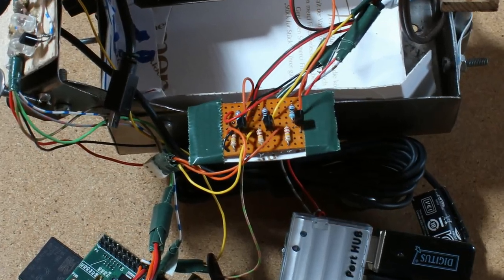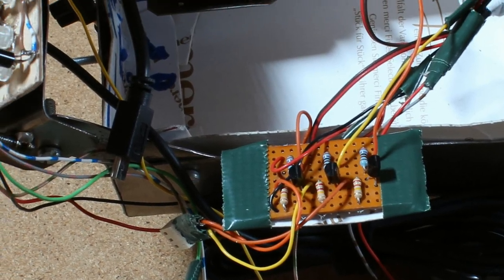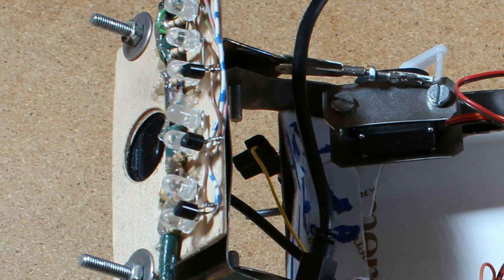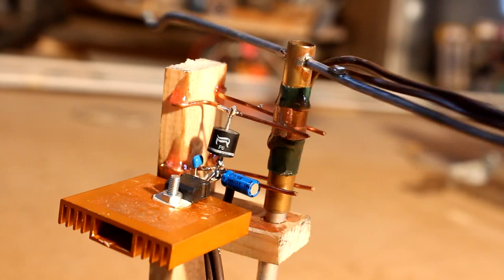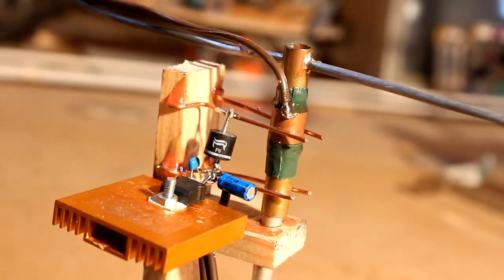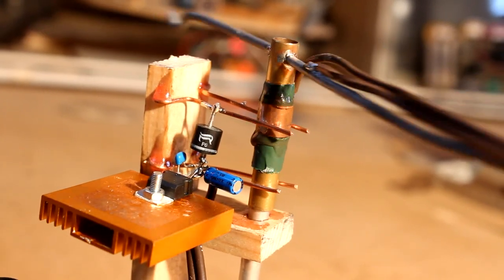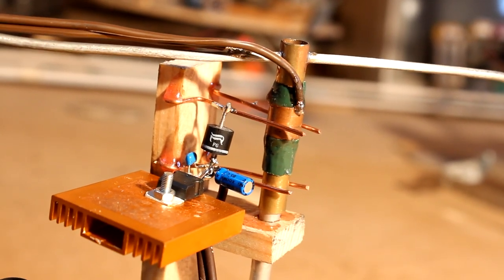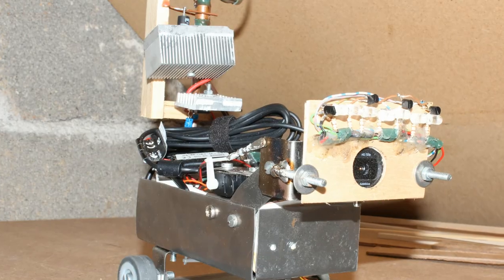The peripheral is controlled by using the GPIO pins, so the electronics consist of just 7 small signal transistors, some LEDs and resistors. The cabling running from the power supply to the rover is long and thin. To compensate for the voltage drop in that cabling, it is attached to a power output of 12V. At the power pole of the rover, those 12V are converted to just 5V.